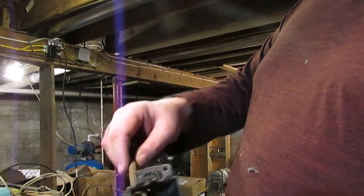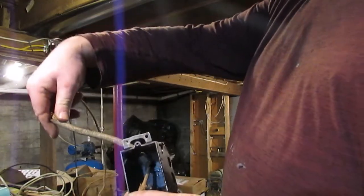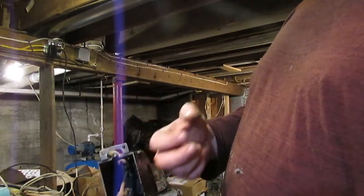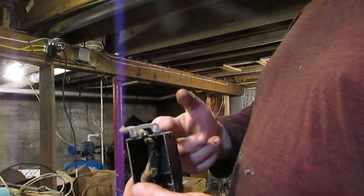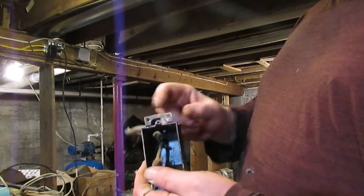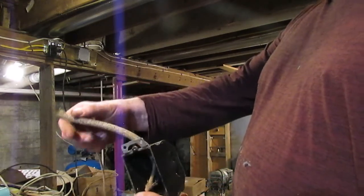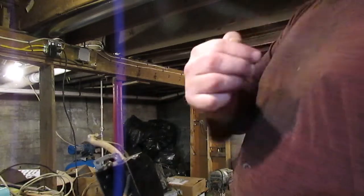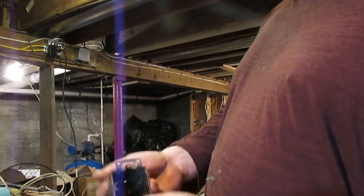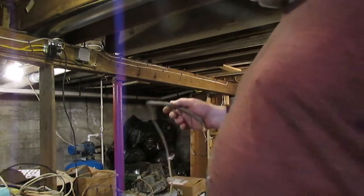the box. And these would have been led off each way onto each wall stud. There was typically a board mounted between the studs that they mounted these boxes into. They'd cut a hole in the board to mount these, and then each wire, this wire would go off this way, and this one would go off towards me. But it was quite an art. And it was a labor-intensive art to put up knob and tube wire.